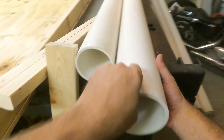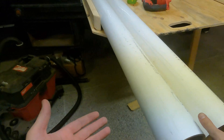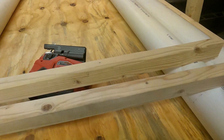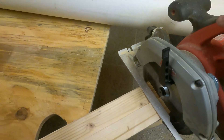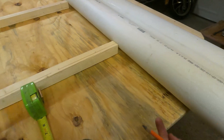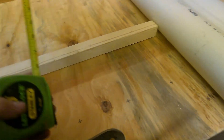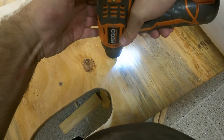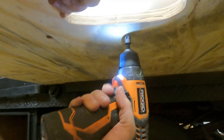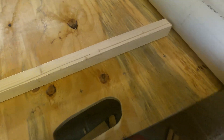We've got three boards — one for each side, made of two-by-fours. I need to mark and then cut these so that they line up with this angle. Let's just test fit this PVC pipe right now. These are a little bit on the long side, but I'm going to chop them right about here. I was thinking I would only have one PVC pipe on each side, and so these stringers are way too long — better to be too long than too short, so I'm just going to cut them down a little bit. Now we're going to mark some pilot holes in the deck so that we can drill into the stringers from underneath without missing. We're about five and a half inches apart, which is pretty good. We'll get under there and make room for the heads of the screws so they sit flat on the deck once we flip it over.